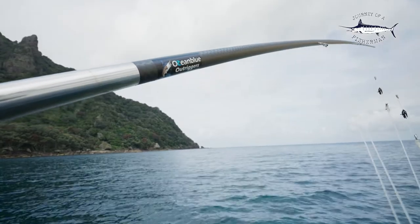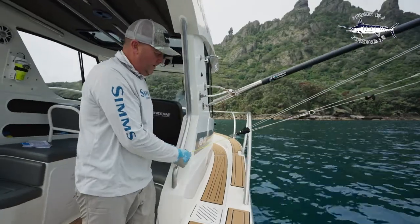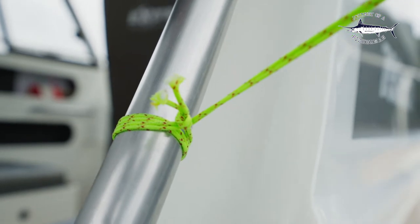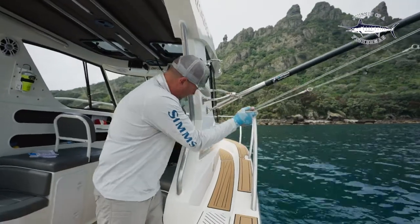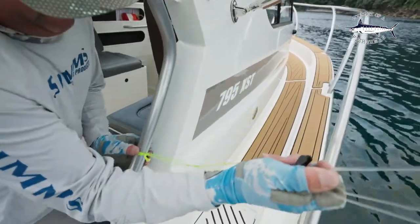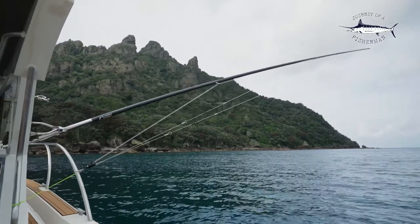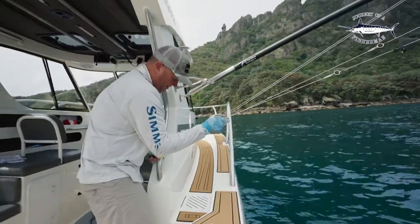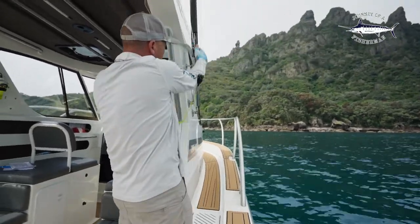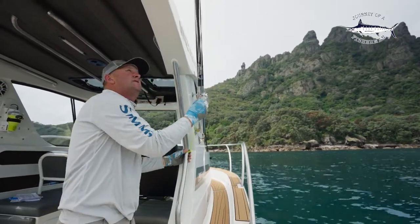You'll see here on our riggers how I've rigged them. I have this little piece of line - I like to keep everything as simple as possible. It's double looped around here, comes back through itself, and by loosening it and pulling it down I can actually control how much tension I have on my riggers. That's where I'd have it when running during the day. If I want to put the riggers back up again, I just pull a bit of tension, loosen that off, pull the riggers up and lock them off - simple as that.